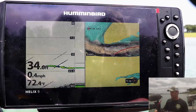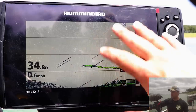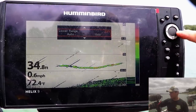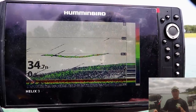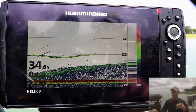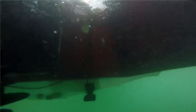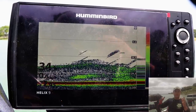I'm showing you my Humminbird Helix 9 unit. The first thing to understand about how a sonar system displays is you're probably looking at the 2D or traditional sonar — it's got a different color palette. The first thing you need to understand is where your transducer is mounted. Is it mounted at the bow on your trolling motor? In my case, this unit is mounted on the stern, just on this side of my large motor. That's important to know because it determines whether you're seeing the fish before you get to it.